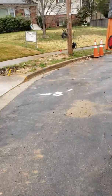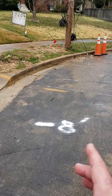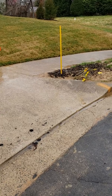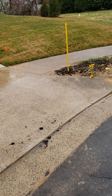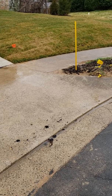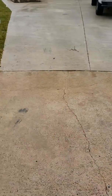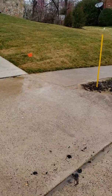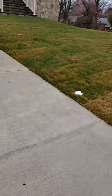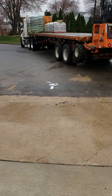So we have to have it replaced — Orangeburg to here — road cut, 8 feet deep, and then a pipe burst underneath there. The depth is about 9 feet deep there and 8 feet deep there — we should be good, we've got good downhill. So we've got to have it replaced. Whether we do it conventionally and take out this whole apron and have it put back or not, after that you've got to de-scale it, because the pipe beyond it is in terrible shape too. The cast iron is just full of scale and buildup. So we need to take it out underneath the road and get all that stuff fixed. That's what we got.